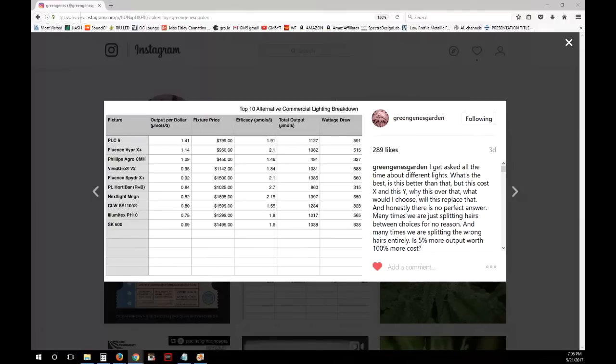Please talk about B versus C. Oh, what's better, Vero B or Vero C, efficiency wise? He asked a bunch of times. The C is a bigger chip, so at the same wattage, it's going to be slightly more efficient. It's pretty minimal. It's just more epi or more chips on the same one.